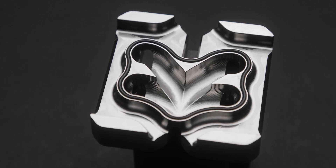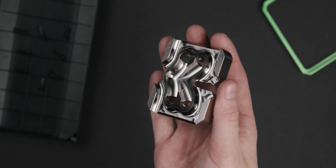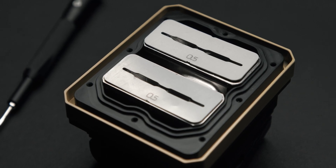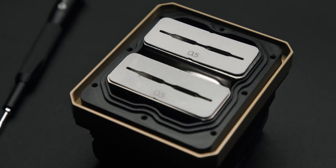The insert actually has four individual branches taking the coolant out directly over the dies. From there it passes through two separated jetplates, and these jetplates have four distinct openings to ensure the flow is focused perfectly over the dies. The inserts, which are used to split the flow, not only direct the coolant, but they also direct the pressure.